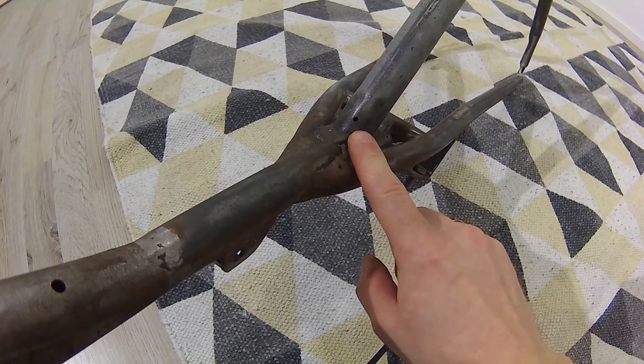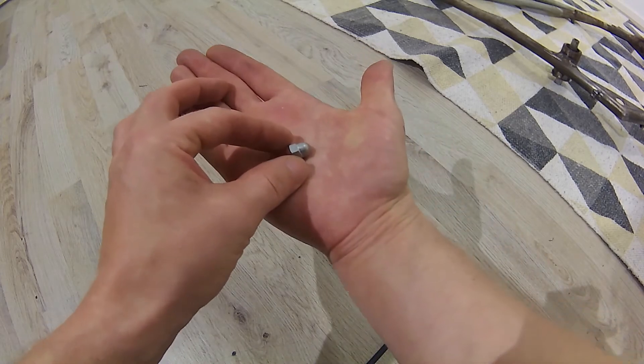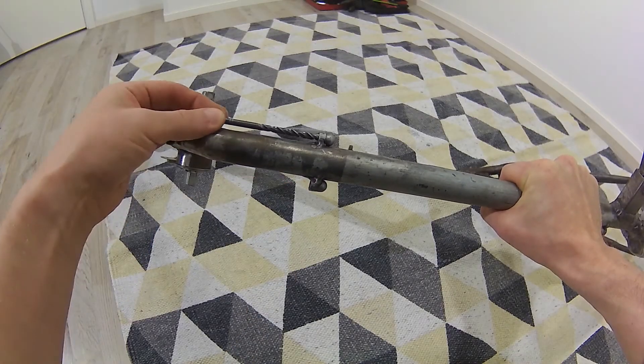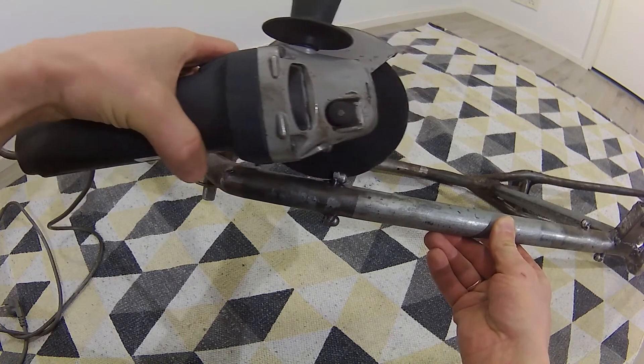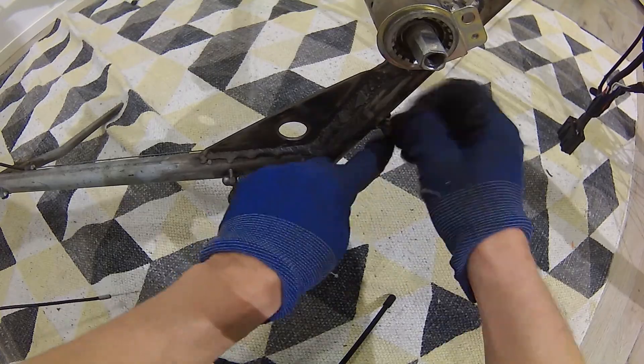Those holes also later help stop your frame from rusting from the inside out because of condensation. Now, because this frame has a much different geometry from a regular bike and it's custom made, you're going to need to attach some cable stops for brakes, speeds, and whatnot. For that I used M6 cap nuts — first I removed the threads and then slashed one side open with an angle grinder. This is a really cheap and effective way of making cable stops, although challenging to weld with a flux core wire MIG because of the small material thicknesses.